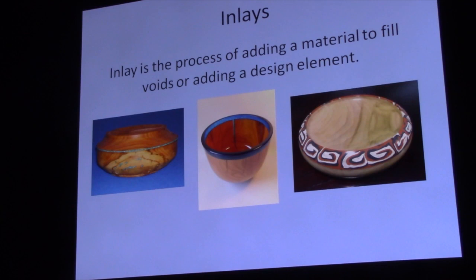Does that one also take 5 minutes to mix like the other one? No, it doesn't. That's a good question. The JB Weld or the Mohawk does not take 5 minutes to mix. You just mix it up till the colors are all the same color before you add any color into it. And that's only a matter of two or three minutes. So it's fairly quick to mix those products up. And then you mix your colorant with it if you want to color it. And again, you can use any kind of iridescent powder that you might have.